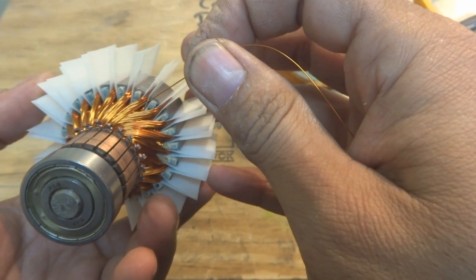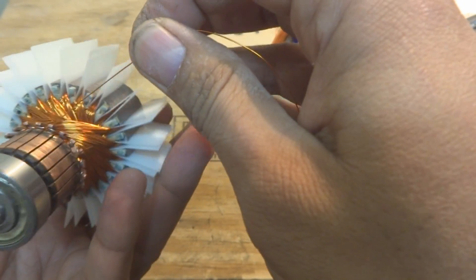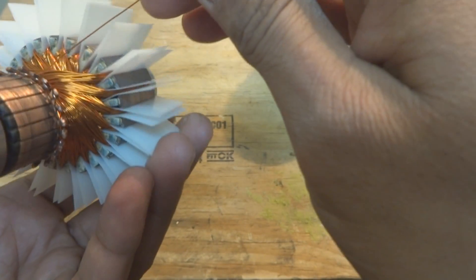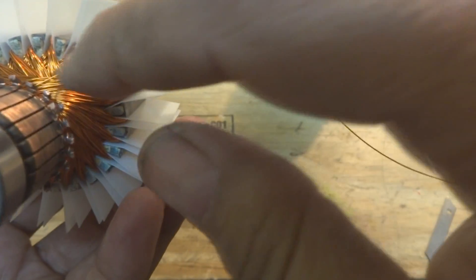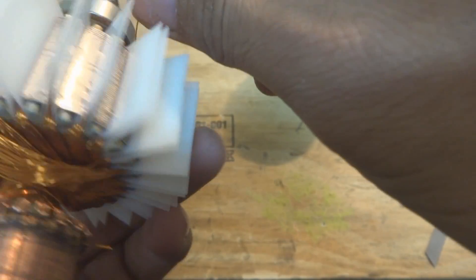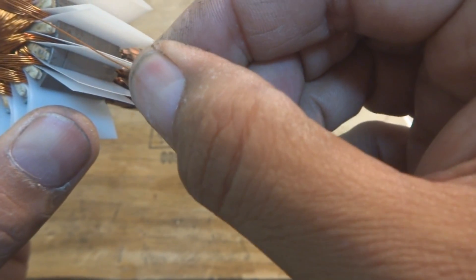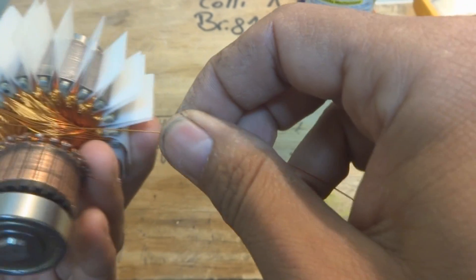Now is the time to go to the ending coil, which is the last final coil in this machine. So it will be here — as you can see, I just rotate it and come to here. This already has one side in, as you can see. One side of the coil is there, and this will be the final side, which will be put over here. Then to the 10th slot — slot 1 to 10 — I have to come over here. This is the 10th slot, as you can see. So I have to wind 18 turns of wire.